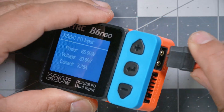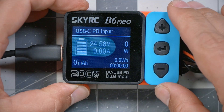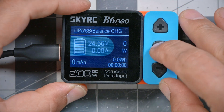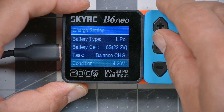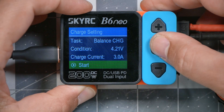Let's go ahead and plug in a battery and start a charge cycle. The charger can do up to 6S, so if you're on that new 8S hype train, this isn't going to be the one for you. If we just push the button, we can see the current state of charge of the battery — battery type LiPo, 6S, balanced charge. I always like to balance charge to 4.21 volts, just because sometimes if you charge to 4.2 it finishes at like 4.19. So I always charge to 4.21. And start.